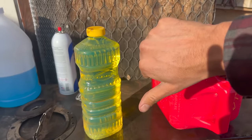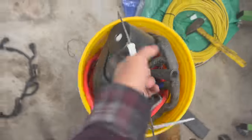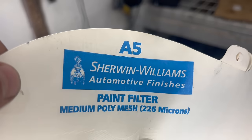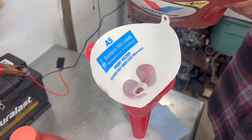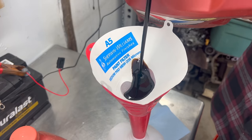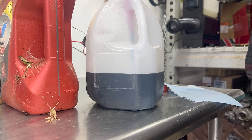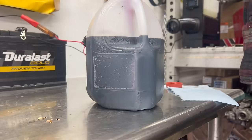Corn oil didn't work well, diesel worked good. Ultimately I decide it's just time to go for the waste motor oil. I said I wouldn't be filtering it — and I don't consider this filtering it — 226 microns is massive. Your normal oil filter filters three to five microns. The point of running it through this screen is just because my oil has sat around uncovered for weeks, picking up dead bugs and leaves. We didn't filter out anything but dead bugs.